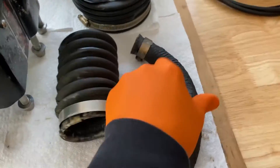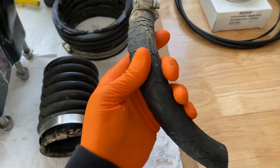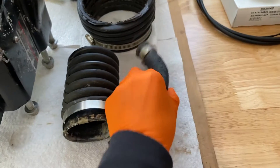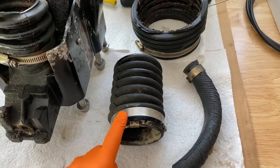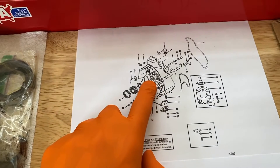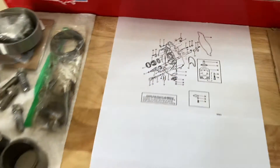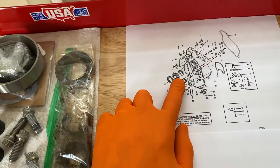Here's the opposite end of the water tube — rock solid, not even movable or bendable. Here's the exhaust bellow that we cut; this portion right here secures to the exhaust on the transom plate. Here's where the shift cable connects, and the U-joint bellow is above that, where you have your U-joint shaft assembly, crossbars, as well as your gimbal bearing and oil seal.